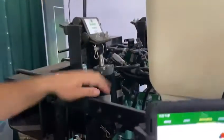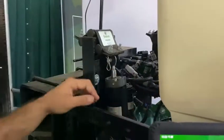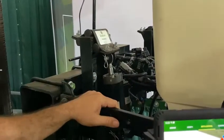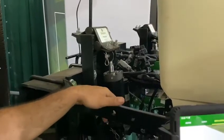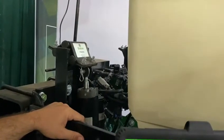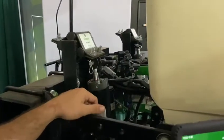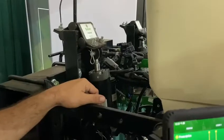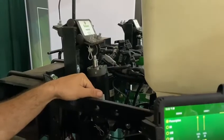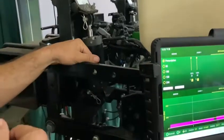What makes the Graham Force unique besides the wireless communication is you have a wireless control board on each row mounted down there, and the actuators are electric over hydraulic — a self-contained hydraulic chamber with a 12-volt motor. To adjust pressure on the gauge wheel, the motor changes position to increase or decrease pressure in the actuator. The actuators run at a half-inch-per-second stroke, which translates to about 150 to 200 pounds of pressure change on the gauge wheel per second, so they act very fast.